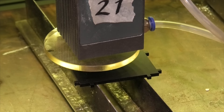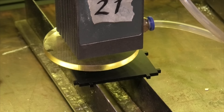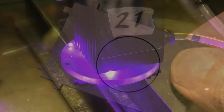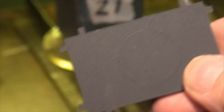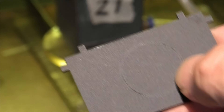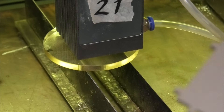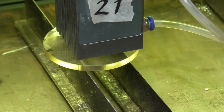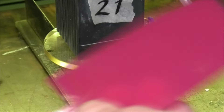At 5mm/s we're measuring the relative amount of damage at fixed power and speed — measuring exposure time to compare relative damage across materials. We're already cutting through the black acrylic — we can see fumes coming out the bottom, it's a nice clean cut. It's nearly out the bottom but not quite, though in one or two places we did manage to break through. That's black, which we expected to be pretty good at absorbing the energy.